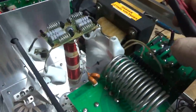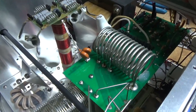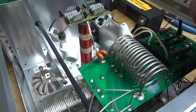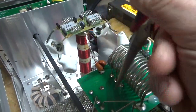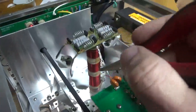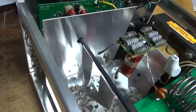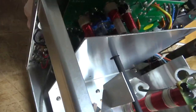So that is about it for now. I'll also put a longer screw in the base of the plate choke, press and clean the socket clips, clean the band switch with Deoxit Gold, the input rotary switch with Deoxit Gold, and I'm going to change the SO239s because these things always end up failing.